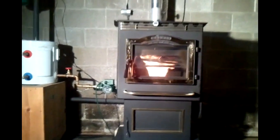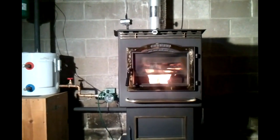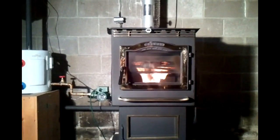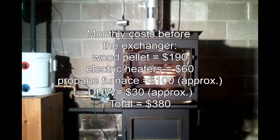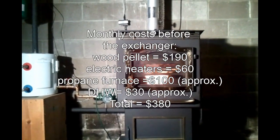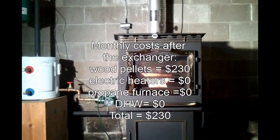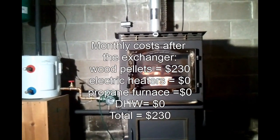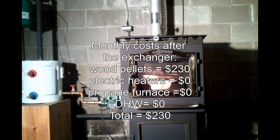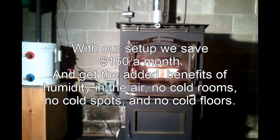I've calculated the fuel usage since we installed this kit. We can heat more space with the same amount of fuel — almost twice the space with about 15% more fuel, and three times the square footage with 30% more fuel. Using more fuel, but saving money because I'm not supplementing with LP and electric heaters, so the savings are quite significant and it's more comfortable.